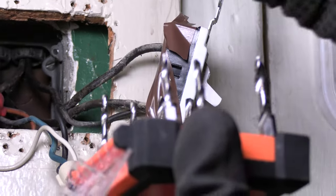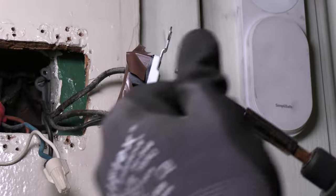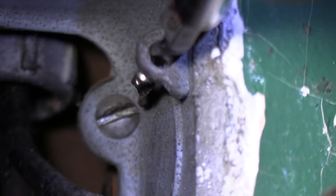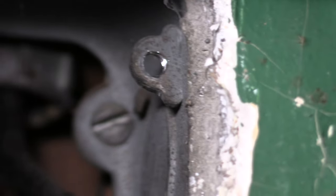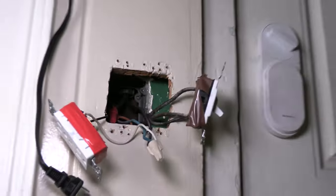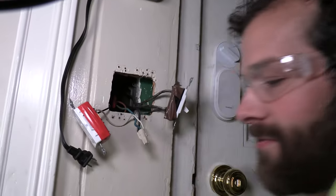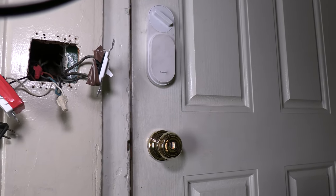I've got my tap set here — it's a drill-tap combination that provides all the common tap sizes for electrical devices. I'm utilizing a 10-32, which is the size of my ground screw, and I'm going to utilize that hole right up there. Very low speed, low torque — I don't want to snap off my tap. These taps are fairly fragile, especially the smaller sizes like the 6-32s. So now that hole is tapped for my ground screw. Could really get wrapped around the axle about whether that hole was UL listed in the original box for grounding, and it wasn't. But is it going to be safer than what I found it — particularly for personnel and shock safety? Absolutely, 100%. So I'm going to do it.